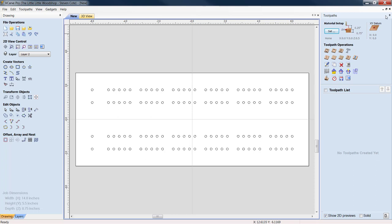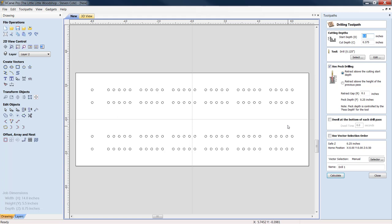Now, a word of advice here, if I may, because I have personally done this myself. You're going to basically buy what looks like a quarter-inch end mill, and it's going to be necked down to an eighth of an inch to accommodate an eighth-inch cribbage peg. That's not rocket science there.